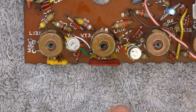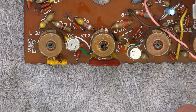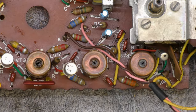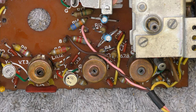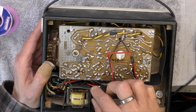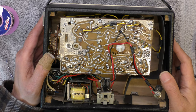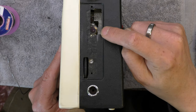Unfortunately I didn't notice until now, but I've actually got a broken IF core — it's cracked and isn't moving. This one's got a crack in it too. I've also noticed there's a lump out of the RF one as well — I didn't notice that as a problem. I'll just leave the IF as it is — it is relatively sensitive so I might have to leave that alone. I need to look back at my own footage to find out where all these wires go properly.